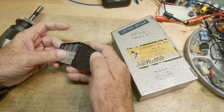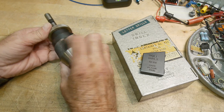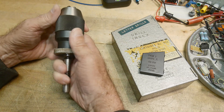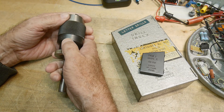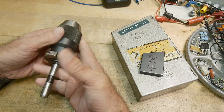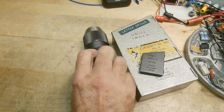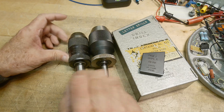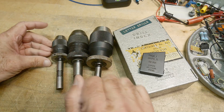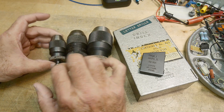These big chucks are beautiful — this is an Albrecht chuck, and it's lovely — but it can't hold these little drills. In fact, this one only goes down to 1/32nd of an inch; it can't hold a drill any smaller than that. Now you can get drill chucks that go to zero. Here's a next size, and this one actually goes to zero. Here's another next size — they get smaller and smaller. This one is a Rohm chuck and this is another Albrecht.